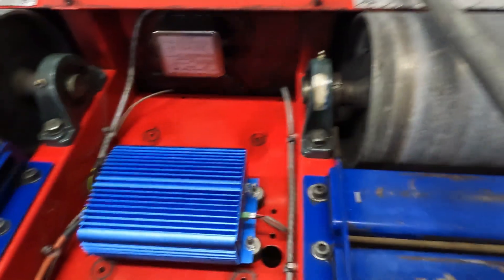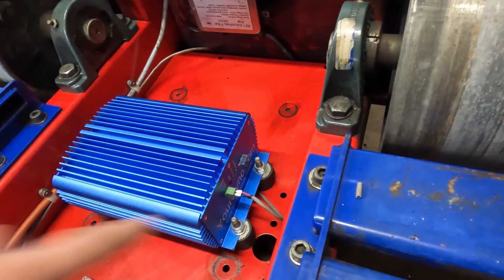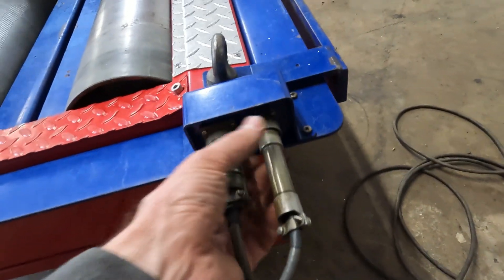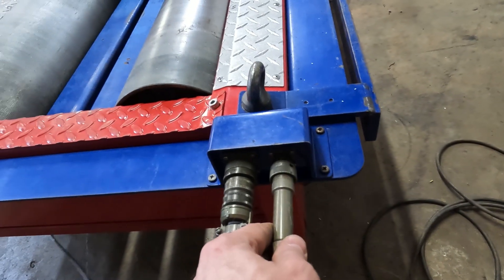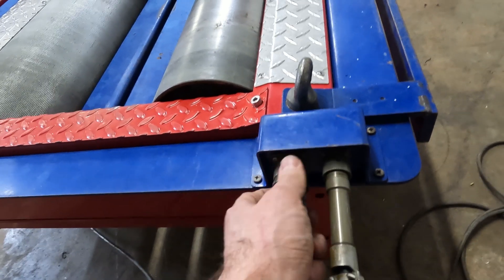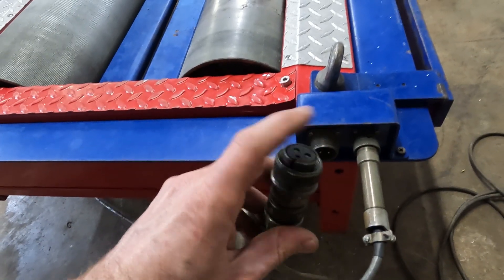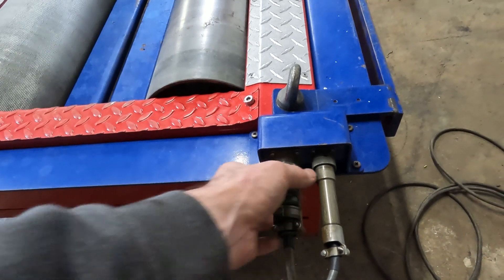On this side you can see the Bluetooth antenna — that's for measuring load and temperature and that sort of thing. And then this is my two-wire PWM. The main umbilical — I got rid of the old nasty connectors and now I have nice quick connects. I have the umbilical I can just take on and off. This is the control cable and this is my mains voltage. It's a 30-amp 240 on a GFCI breaker, and you'll see we have the female side here so when this is plugged in you can't get shocked. These two can just be removed easily and coiled up so I'm not dragging them around when I'm moving the dyno.